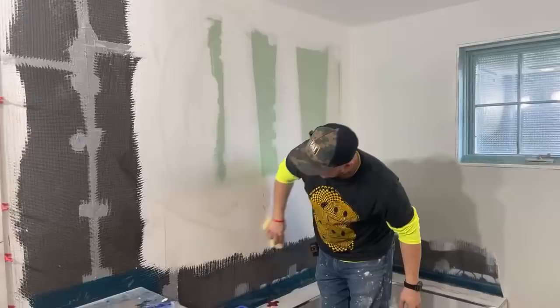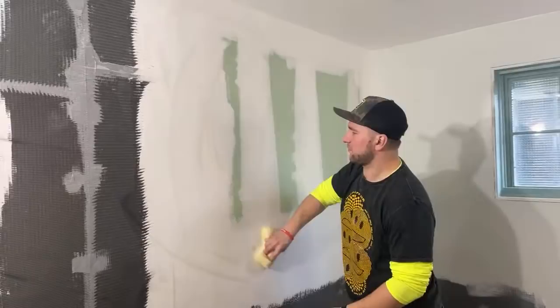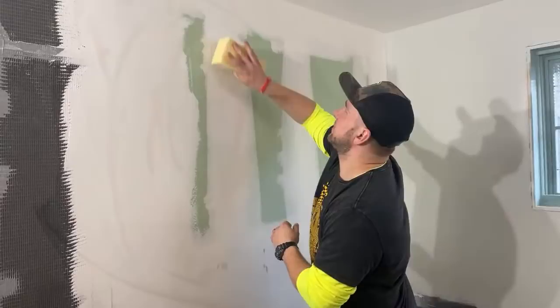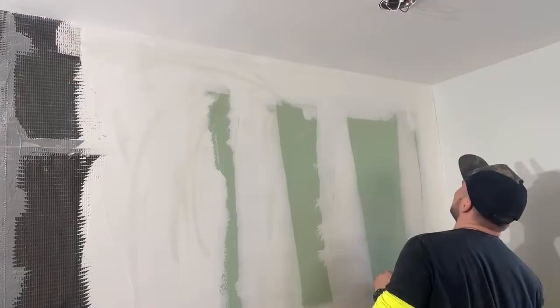So painted wall is sketchy because there's basically that little film over it. So what you're bonding your tile to is just that film. So that is sketchy. When we have a painted wall, what you want to do is get a box cutter and just go Freddy Krueger on it. Just chop it up. So you're kind of cutting through that paint. And if you can scrape some of it off, scrape some of it off. If you can just demo it, that'd probably be the best.